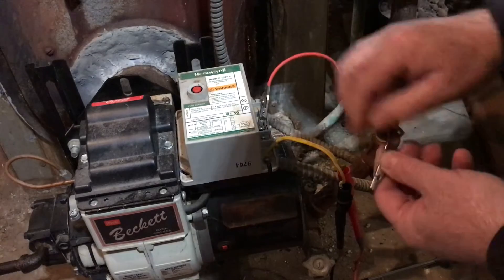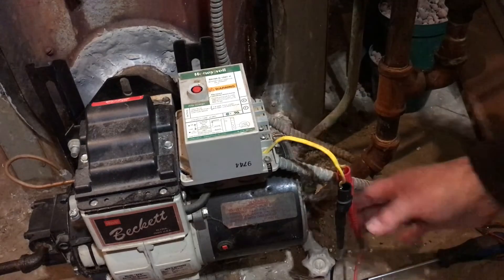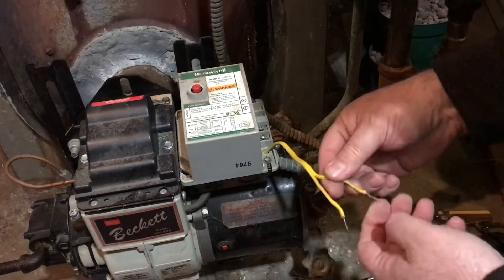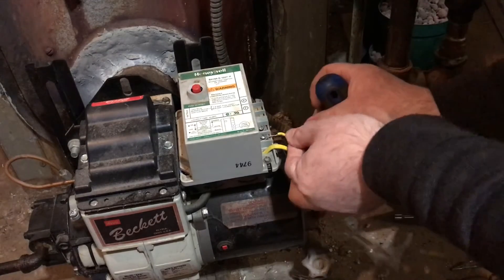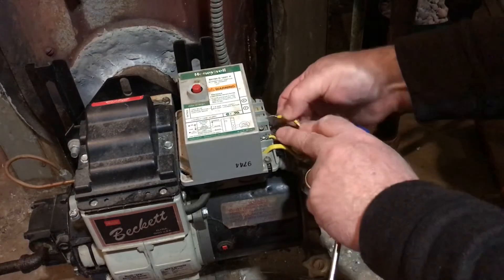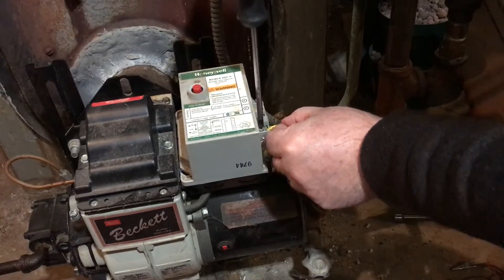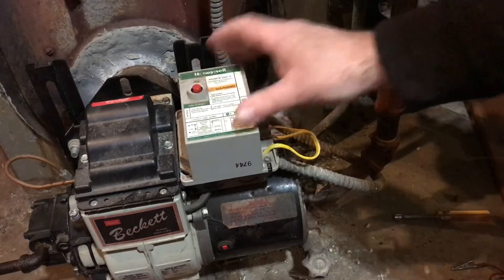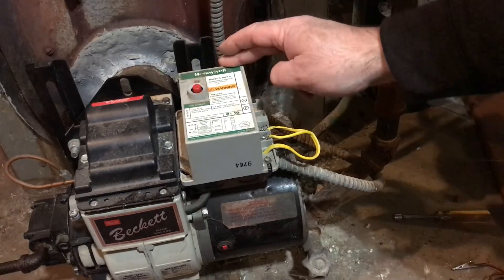I'm going to take this jumper off one more time to make sure it locks out again, because that's how I was shutting it on and off. There it goes — we're good. The wire feels good, it's not too brittle. There's no corrosion here, no corrosion here. A little bit of dust but no corrosion. Polarity does not matter. And that pretty much concludes checking out our CAD cell relay for function and correct operation. If you have any questions or comments, please leave them in the comments below. Thank you for watching.